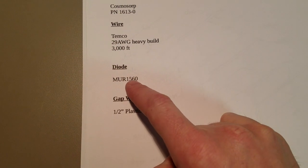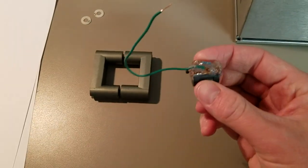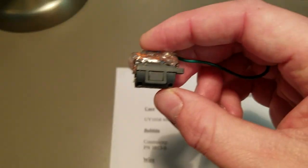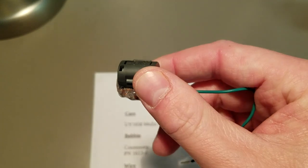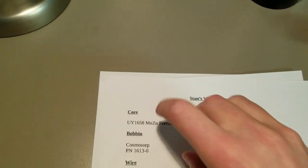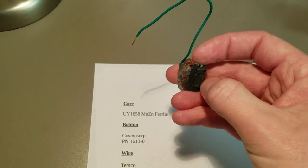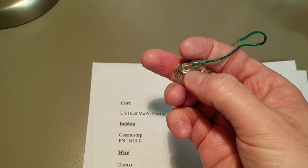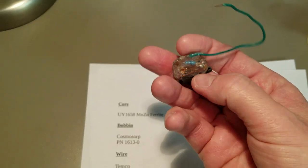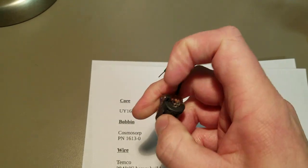There was one other thing — this is a little ferrite bead, I forget the exact terminology, it's made by TDK. It's basically a ferrite inductor. You can take some small gauge magnet wire — 29 or 30 gauge — and wind it around there, then put a high ohm resistor, I think that's a 10 meg or something. You can also do a diode and attach a ground to it for the oscilloscope. I use that as my pickup coil to watch my frequencies so that I'm not exposing my oscilloscope to high voltages.